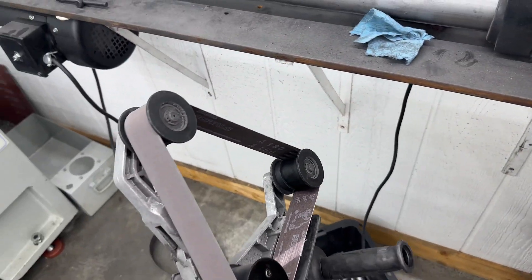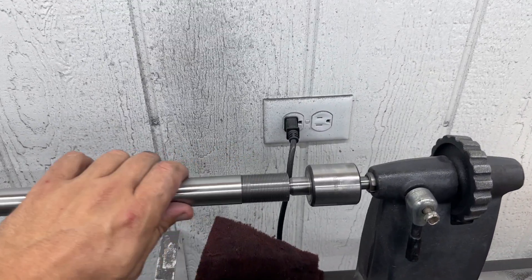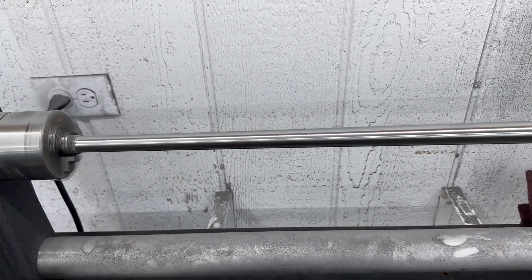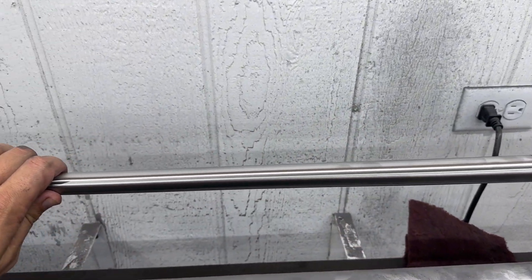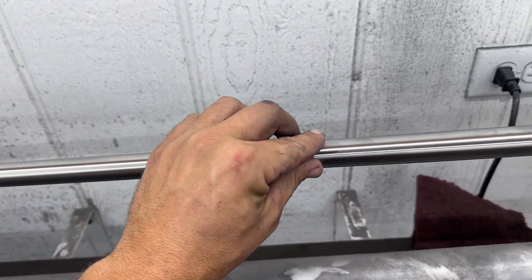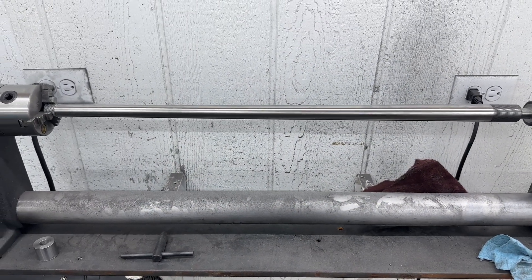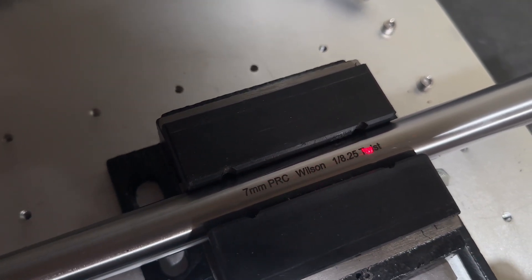The final step - I use a flexible belt sander, and I made my own barrel polishing unit out of an old wood lathe. I made a spindle for it that takes a three-jaw chuck and a live center, turns about 500 RPM nice and slow. The first pass goes against the barrel to take off any imperfections, then the final pass goes with the grain and gives it a nice hatch. Then I go over it with emery cloth by hand. The final step is laser engraving - I wipe it off with Mr. Clean Magic Eraser to get rid of all the smoke, and that is that.